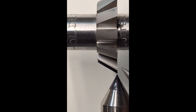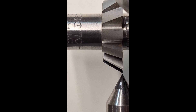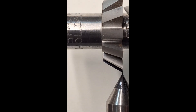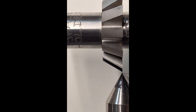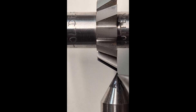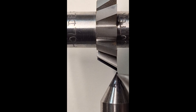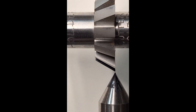As you draw your head to the front of the machine, you can see those teeth receding away, getting close to the right point. They're just disappearing, and as you go too far you can see this line creeping out over the far side. Realistically you're going to be focused over the portion nearest the centre, and that's where you've got to concentrate your vision. Those indications tell you really where you are with your eye line over or not over the centre line, which is the crucial bit, because the cutter at this stage still needs to be adjusted.